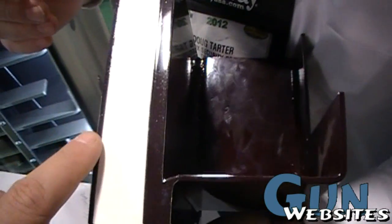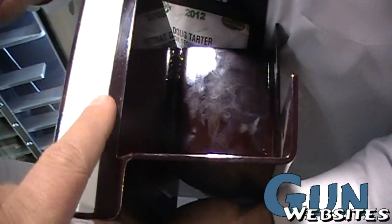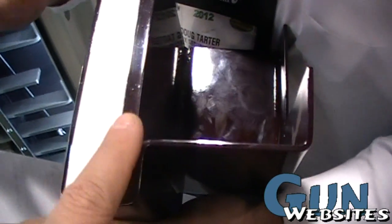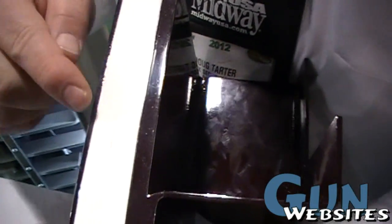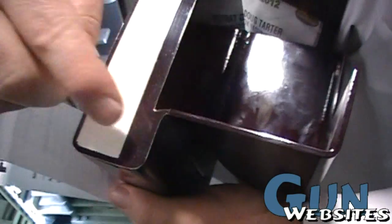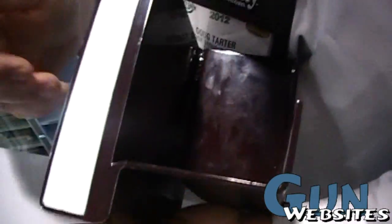Correct. And it looks like you've got the 10 gauge on the outside, then your fire protection, then your big piece of security steel, so this is isolated from fire, so you're not running into a risk of attack after fire. Correct. Plus you get your extra piece coming all the way around, so you get 3 pieces of steel on the pryable edge of the door. So it's a great way to go.